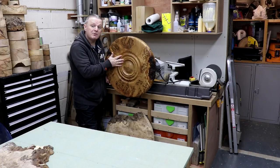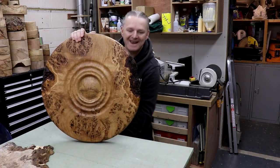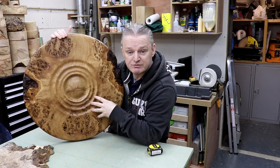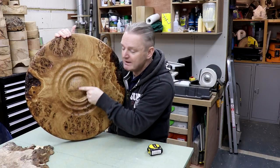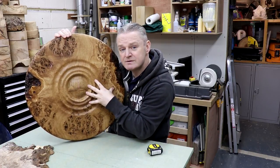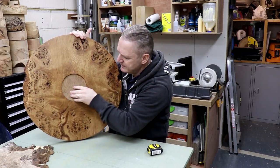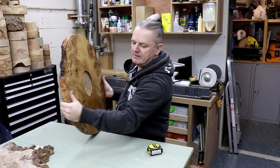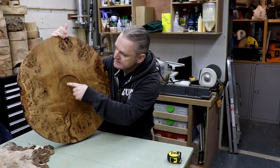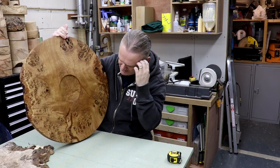Okay, so there we have it. It's just had its final coat of tung oil. Let's take it off the lathe and have a closer look. Oh, I like it, I like it, I like it. There we go guys — there's my Pippi Oak Wall Art. It's 595 millimetres, which is about 23 and a quarter inches in diameter. It's got copper inlays in some of these cracks — I didn't do it in all of them. It's had five coats of tung oil and that's now dried out. And on the rear also — yes, I need to oil that. Okay let me oil that then. I forgot about that! Whoops. Nice coat of oil in there. As you can see, I've also put copper inlay and infilled all the cracks on the rear with copper, just in case anyone ever turns it around.